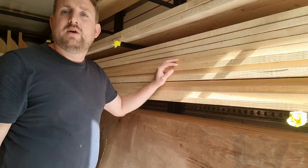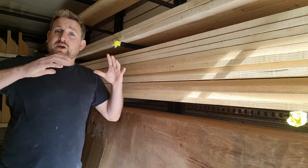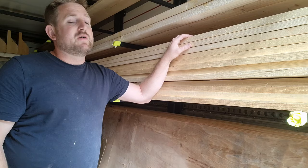So traditionally, I guess they probably would have used whatever they had to hand. It wants to be dry. Ideally, you want some dry wood so that it's not going to shrink and then start to rock. In that one, you can see why it's so firm even at this age, just because we left it out in the rain. That really helps keep the joints tight. Whenever it dries up a bit, chuck it out in the rain for a few days, and it tightens it back up.